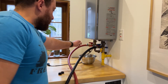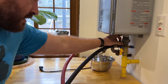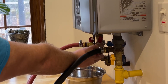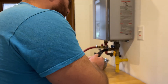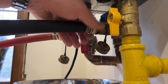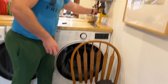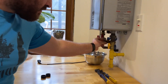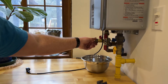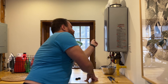The water heater is still filled with vinegar. I'm going to start by turning off these cleanout valves that connect to the hoses, then turning on the valves that connect the heater to the water system. I'll disconnect these hoses — loosened with the channel pliers — and then put the end caps back on the cleanout side of the valves. These can be finger tight because they're not designed to stop liquid flow; the valves do that. Now I'm going to plug the heater back in, but I won't switch it on just yet.